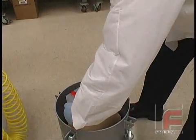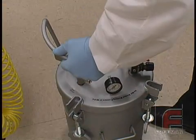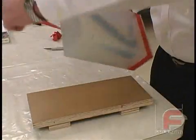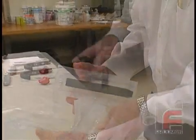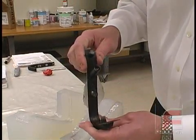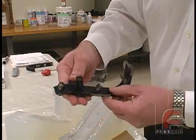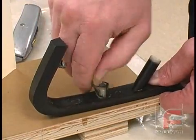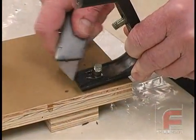After filling the mold, we put the mold into a pressure pot to cure under 15 psi of pressure. The next day, we are removing the tape, separating the mold halves, and then removing the part. Notice how the urethane formed a slight flashing around our parting line where our clear tape used to be when we created the mold. We remove the plastic covering the threads, and then we use a utility knife to remove the remainder of the vent material.